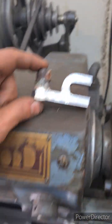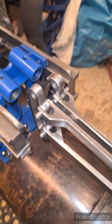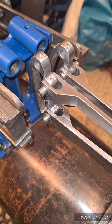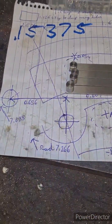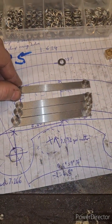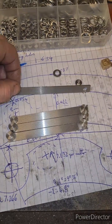Careful cuts, slow going, but all good. There's them in place. I've just got to drill the pins and put the split pins in. Before I harden the pins, I've done the die blocks on there and now I'm just doing the lifting links. This is actually gauge plate, which will harden - I think it did when I silver soldered the buttons on.